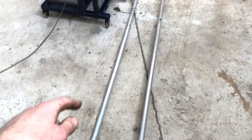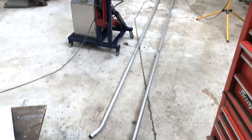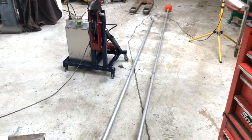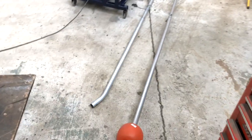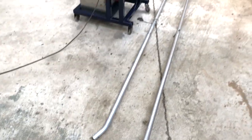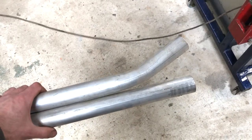I've got a little job for it. What I want to do is reduce the length of these skids — they're extended skids for when I'm teaching myself to fly the helicopter. They're a bit too long, so I've got to re-bend the end after cutting. The bend I want to recreate is 25 degrees.